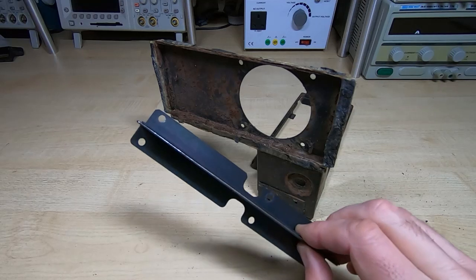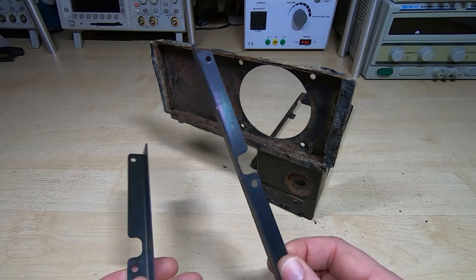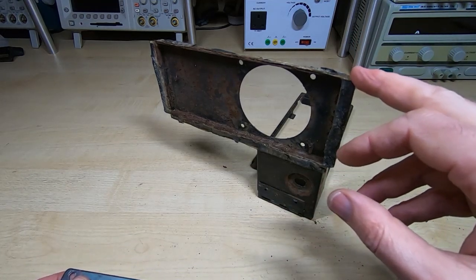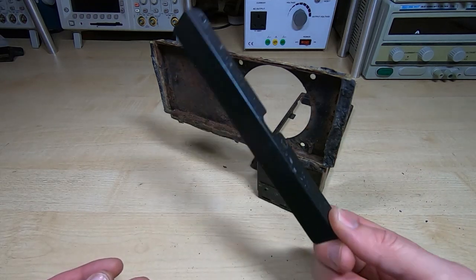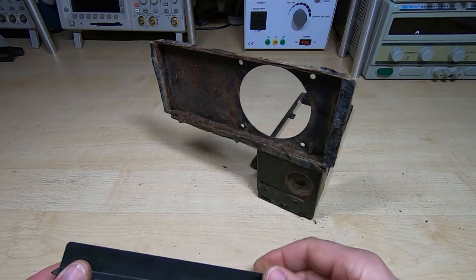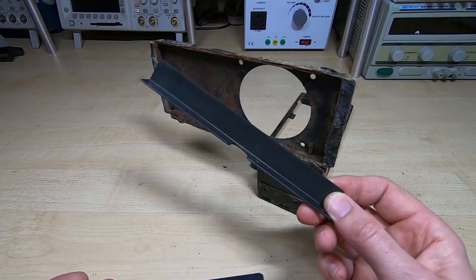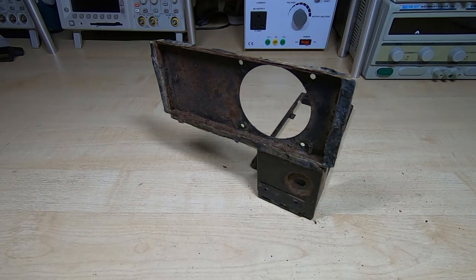But some of the pieces that have oxide on this machine, I also need to refinish. The process I'm going to show here will work just as well whether you're refinishing a piece that's oxide coated or whether it's painted. One thing to bear in mind though is that a piece like this, if you were to put it into something like Evapo-Rust, that would take the rust off along with a lot of the loose debris, but it would leave the paint intact. But Evapo-Rust will take the black coat off these. Evapo-Rust removes the oxide layer, normally the rust of course, but in this case it would also remove the black coating, if that's what you want. All well and good. Otherwise just be aware of that. Don't put black oxide parts into something like Evapo-Rust, because it will ruin it and you will then be forced to refinish it. So how I go about doing this, as I say, varies depending on the particular component.